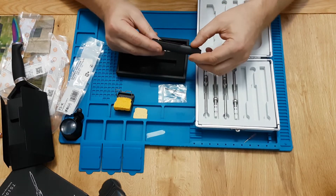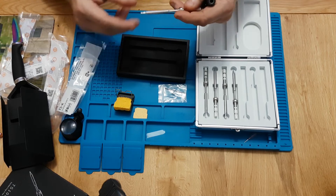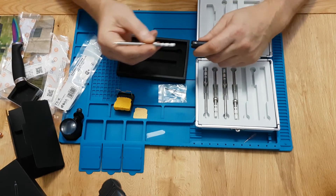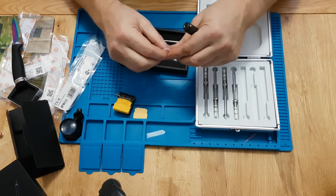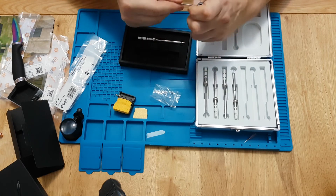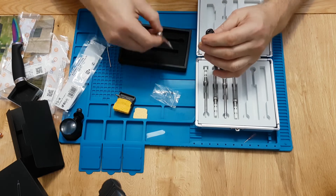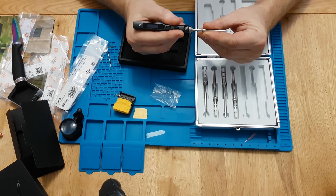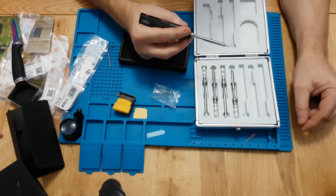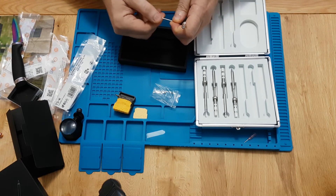Take that cover off and it's got what looks like a power button and temperature up/down buttons. It also comes with another tip — a very small-ended tip, I think this one is the BC2. The screw is fully driven home so don't try to force the tips in when you first get it; make sure you loosen them off first. Set the direction you want the tip to work at — I'd probably have it facing down or just slightly off-centre. Tighten it up without over-tightening.